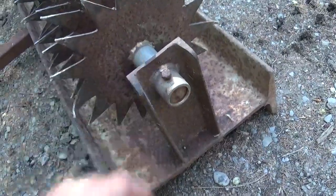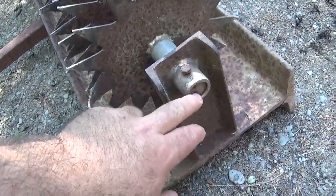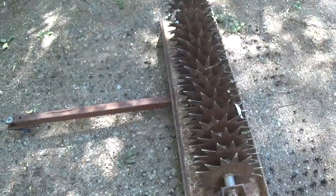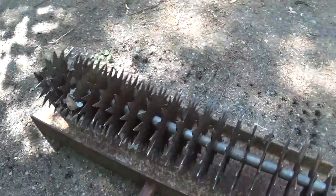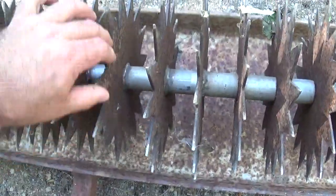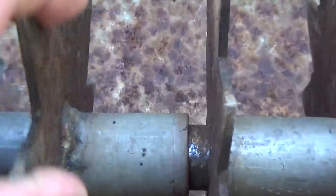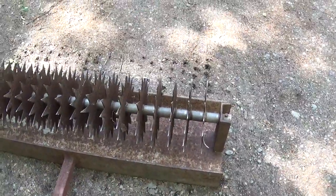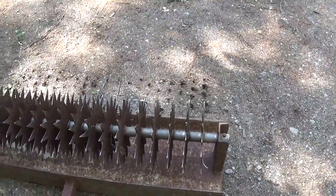What I'm thinking is: get a three-quarter inch shaft and run a one-eighth inch Teflon tubing all the way through, so each little wheel would run on Teflon. Or maybe grease each wheel individually. It doesn't seem to have any lubrication between them — it looks rusty. So I'm thinking about the Teflon tubing inside, shrinking the shaft down to three-quarter inch to reduce the noise.